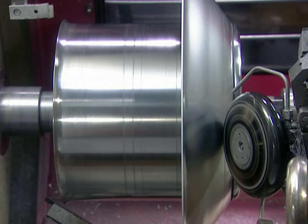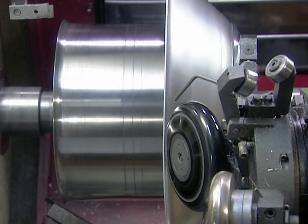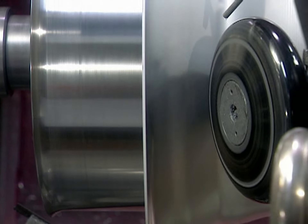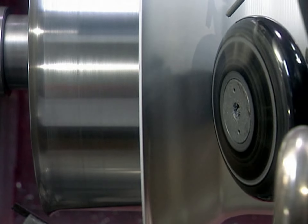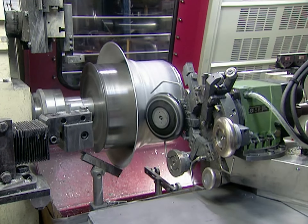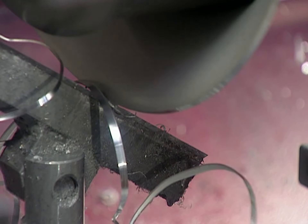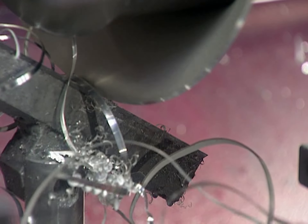The lathe spins at 2,000 revolutions per minute. Guided by computer software, the spinning tool — a round wheel made of special plastic — pushes against the chuck, stretching and shaping the aluminum blank, much the way potters stretch and shape clay against their hand on a pottery wheel, except that metal spinning works sideways, not up and down.